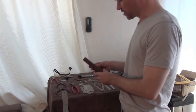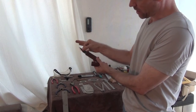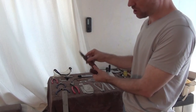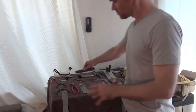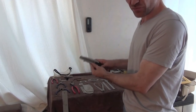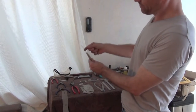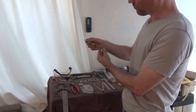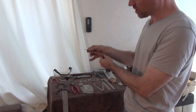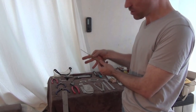I've got a wide variety of knives. I particularly like this Japanese knife for neck carving — it does a really good job on certain parts of that work and I keep it nice and sharp. Any kind of disposable knife, you're just going to find yourself reaching for one of these all the time. I use an awl for placing dots when I'm doing inlays, starting off drilling holes, side dots, all that sort of stuff. Awls are really handy tools to have.